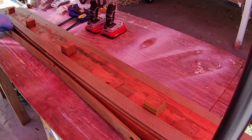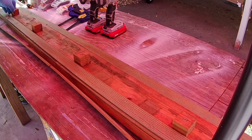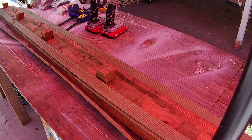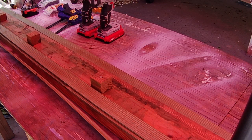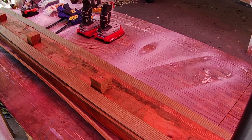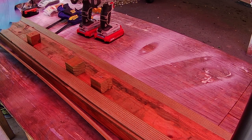This is the 8 foot straight stringer template. I've selected 4 relatively straight slats together with a couple of wonky ones, we'll call them. The idea is any stresses or curvature in one slat are opposed by the neighboring slats. The slats are then assembled between spacer blocks, three on either side. What I'm doing here is placing the separator blocks every 8 inches along the length and carefully choosing which side goes up to best resist the weather, if there is such a thing.